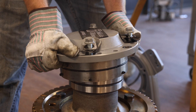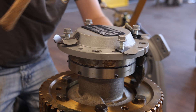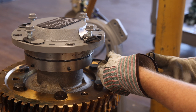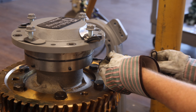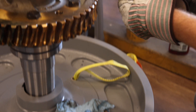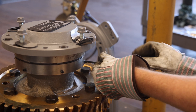Next, install the original non-traction wheel side eccentric over the bearing. A gentle tap from a hammer may be necessary to fully seat the eccentric over the bearing. Next, using the T-handle hex key, back out each of the six cone point set screws from the eccentric one at a time. Before reinstalling each cone point set screw, dip the set screw in Loctite 243 as shown. The Loctite 243 is provided with the tool kit. Using the T-handle hex key, reinstall each set screw and tighten.